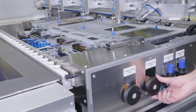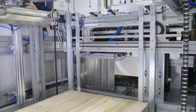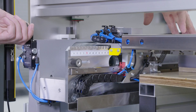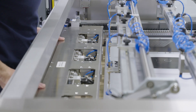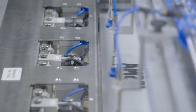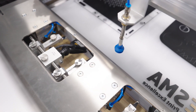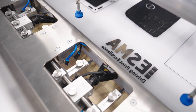The stack side guides equipped with ionized air blowers can be easily adjusted via adjustment wheels. The back stack positioner is pneumatically locked and can be easily moved into position. It is equipped with pneumatic pushers to constantly maintain a good pre-alignment of the substrate during take-off with the vacuum gripper. The back stack positioner is also equipped with ionized air blowers to enable perfect substrate separation.